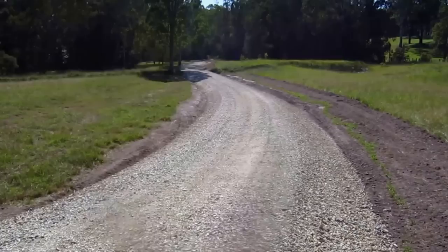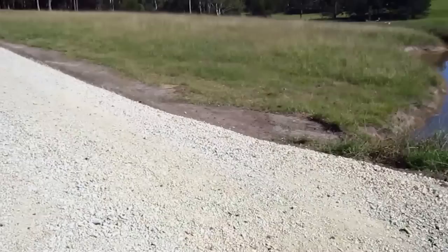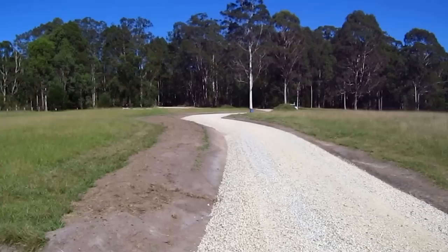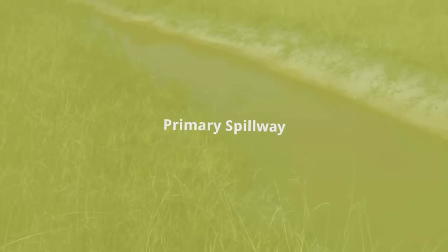Here we are on the road and it's got a lovely crown shape. Some water sheets off over the side, so you don't risk water tracking down the road itself. We've put a bit of pattern into it so it's not a straight line. Of course it's going to be treated up on the sides and it's quite aesthetic — functional beauty, I call it.